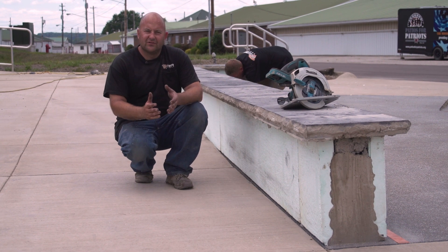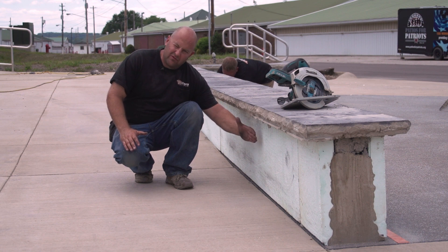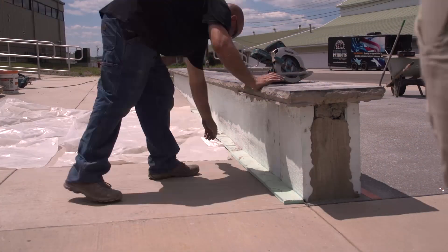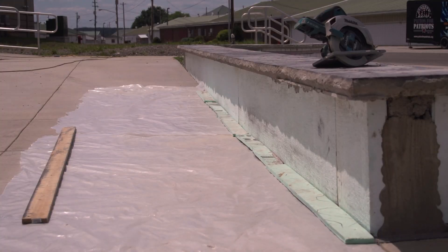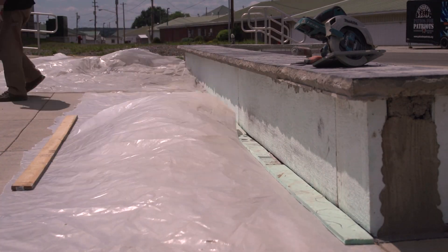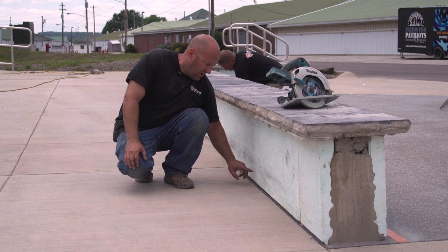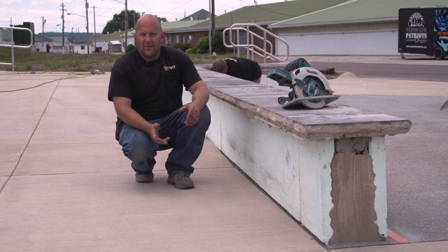Today's technique is we're going to put a facade on this — some vertical mix and carved stones — and that's going to overhang this probably an inch and a half. Here in Ohio we get a lot of freeze and thaw in the winter, so this could go up as much as one inch. If it freezes underneath and hits these stones, it could pop this off, raise the whole thing up, or make a heck of a mess.